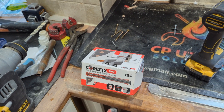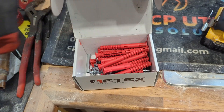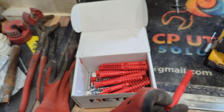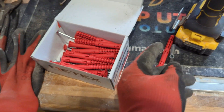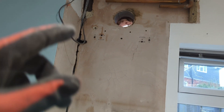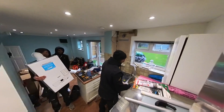Having quite a bit of difficulty with the walls - it's dot and dab. I tried 7mm plugs but the screws are just spinning, even with slightly longer ones. So going to have to use these core-fix ones. When you've got dot-and-dab walls and your screws are just spinning, these are actually perfect. Drill a 10mm hole, pop that in, then you've got the little metal inserts that bridge the gap between the plasterboard and the blockwork, and then you've got these super-long screws. Once this is on it shouldn't go anywhere - we were trying to put the boiler on and the bracket started moving because it wasn't held on properly. So I'm taking the bracket off and redoing it with these. Right, let's try that again.